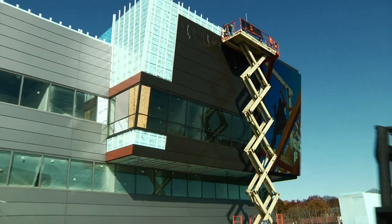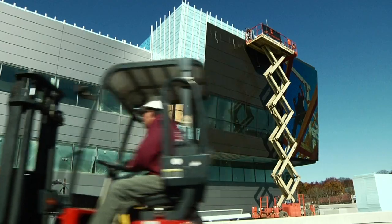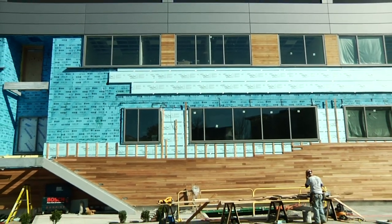My name is Paul Pappalardo. I'm out of local 2168 and I'm working for Alleghany Contract Flooring. We're working at the Carpenters Hall. We're preparing the floors and pouring underlayment, and we're leveling them within an 1/8 in 10 feet.